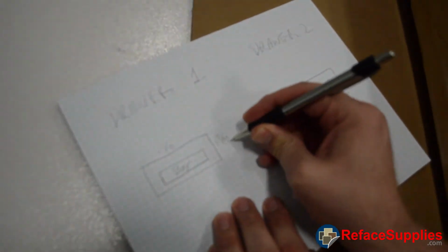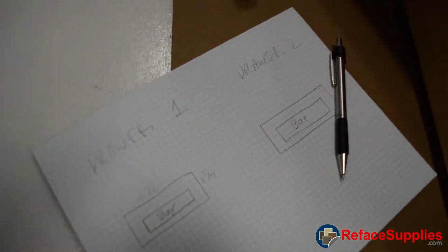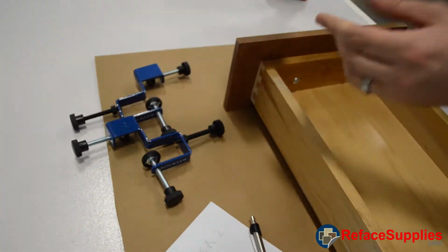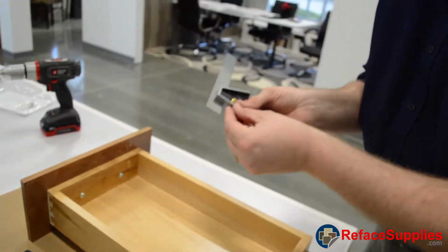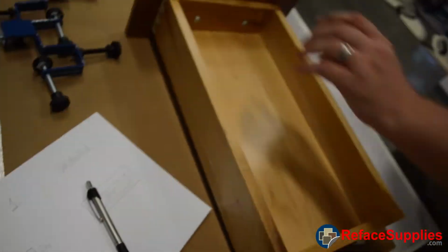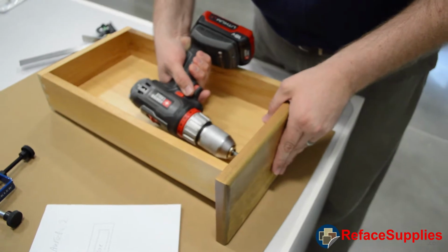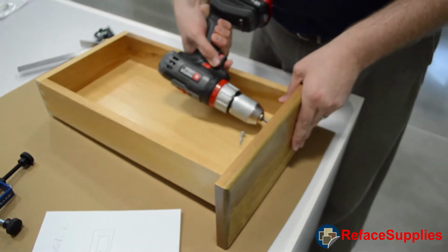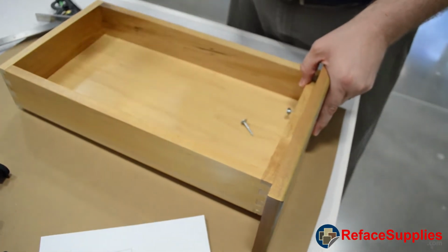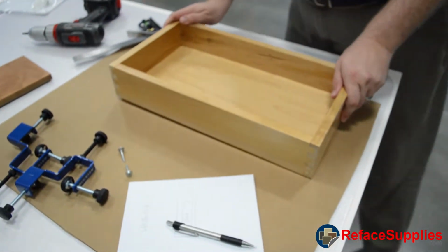It all depends on what was used to fasten the old front on. Some are held together with screws, others with staples, and yet others with glue. It gets a little more difficult if a combination was used. If you have difficulty removing a front, try to break it loose by carefully using a chisel and hammer. Slowly work your way around the perimeter until the front separates from the box.